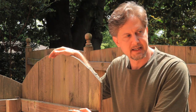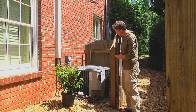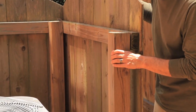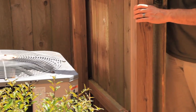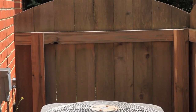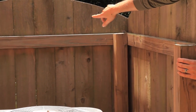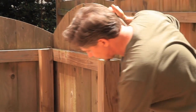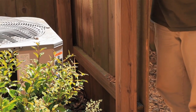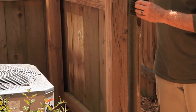If you custom make the wooden fences to hide the air conditioner units, you'd first of all need to start out with four by four posts. In this design, we've actually put a four by four post here, another one in this corner, and another one in that corner, and left this open for access to the unit. I've also gone back with a two by four and put it on the front of the four by four post — as shown right there at the very top and also at the very bottom — which will act as a brace so you can go back and put your custom planks or your pre-made fencing on.